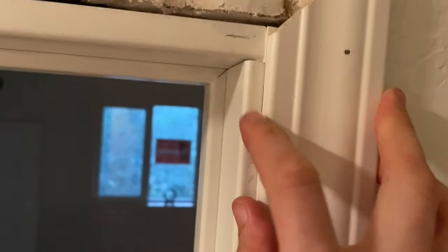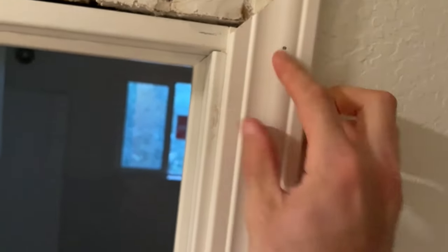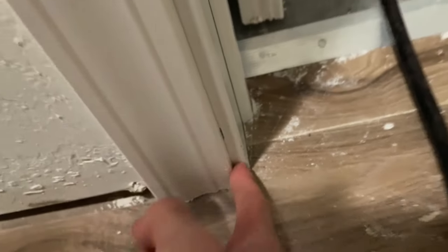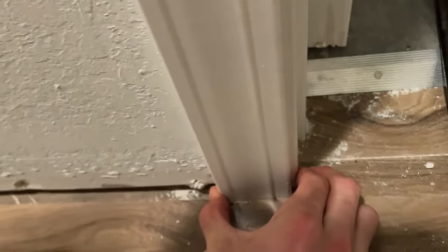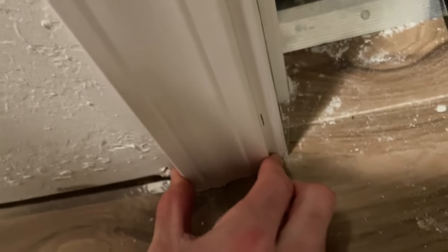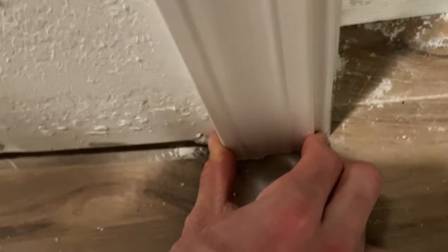This is how things are looking — you can just barely see the edge of that reveal mark. You start from the top and work your way down. The casing does bend a lot. If there's too much reveal in a spot, you can pull it with one hand and then drive in your brad nail. You're physically working down the casing, lining it up right where you want it.